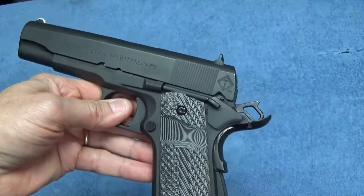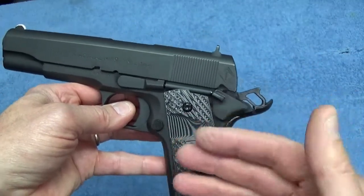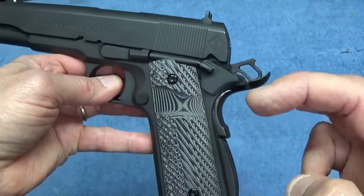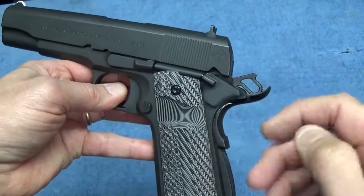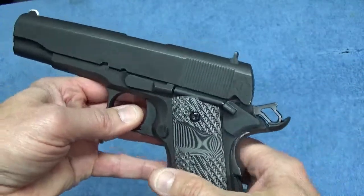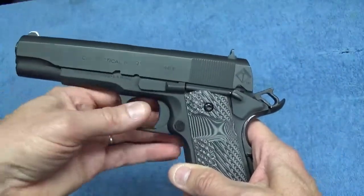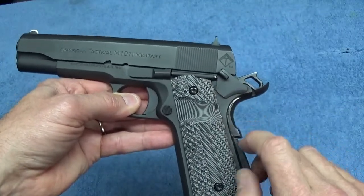What I have read from people that know a lot more about it than me is when you let the slide go onto an empty chamber, it does bounce around inside the hammer hooks and can muck up the nice sharp angles on a good hammer like the one I just recently installed. What I normally do is check it, lock it back, release it, leave the hammer back like that, and put the safety on to lock the slide into position.